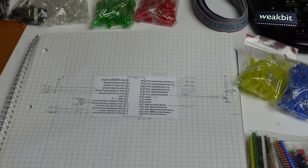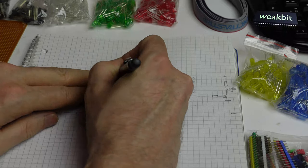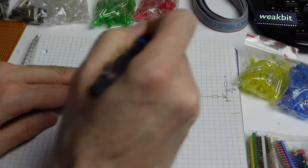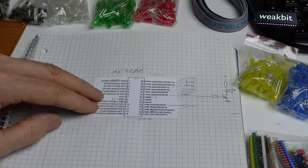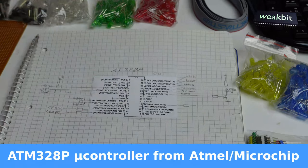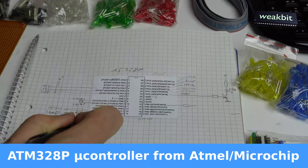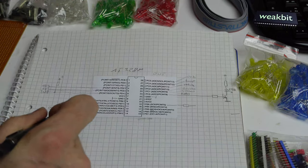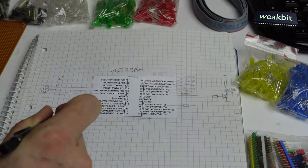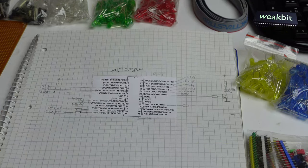In our case, we're using a microcontroller. The type is an ATmega328P. This is an 8-bit microcontroller, and this 8-bit microcontroller I printed out. I'm designing in, here is an input from one. Here is the output to close and the output to the open motor. This is going to an H bridge. I will show you this.